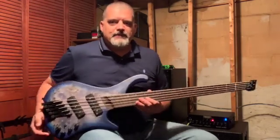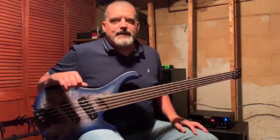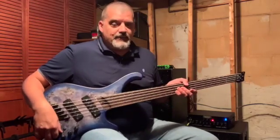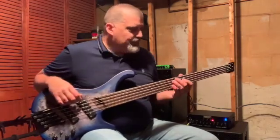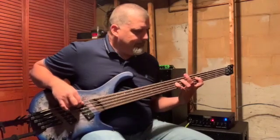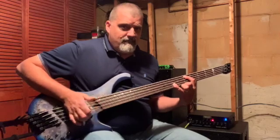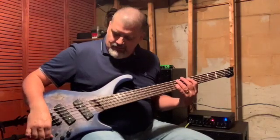So it's really helpful when you need to get a certain tone. Maybe if you can't get that annoying frequency EQ'd out from the amp, you've got it right on here. You can get your sound, you can fine tune it quite a bit, and that's why I love the adjustable mids. Here I'm going to roll all the way down to the lowest end of the mid frequency, and we are now boosted. I think 100 hertz. Mids boosted all the way, real strong in the low end, right? Cut all the way.